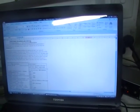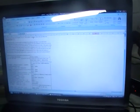So this is a copy. This is where the article I wrote up, and what we've just done is talked about all of this programming the number in, the speed steps, and setting up the throttle. So let's look at what we've done. And down here it discusses what's happened in CV29, whether you've set it up so you can run it on DCC, on DC, or not DC, just running on DCC only.